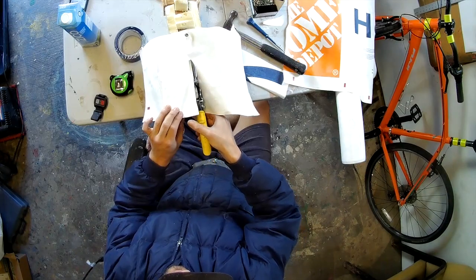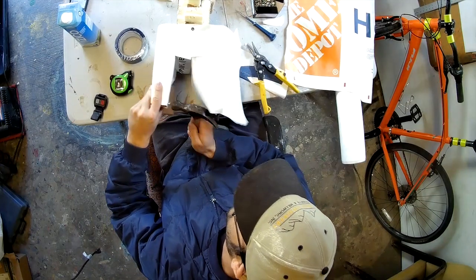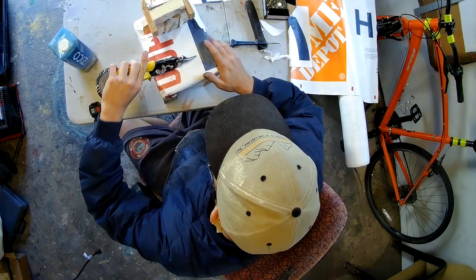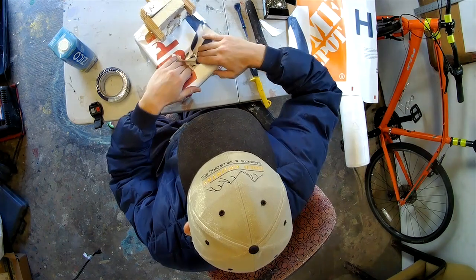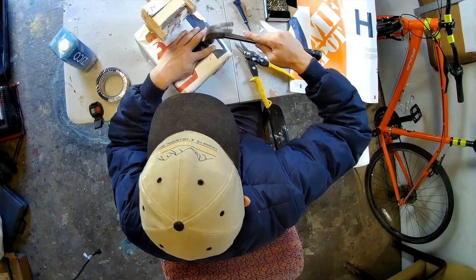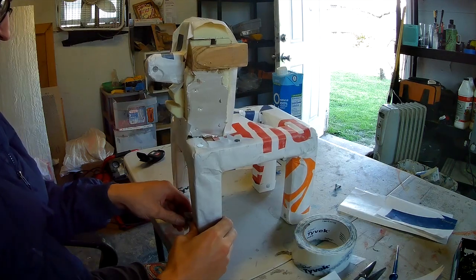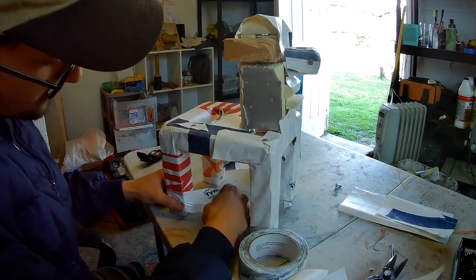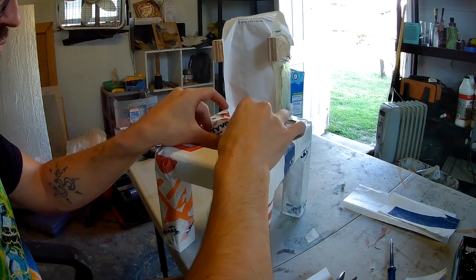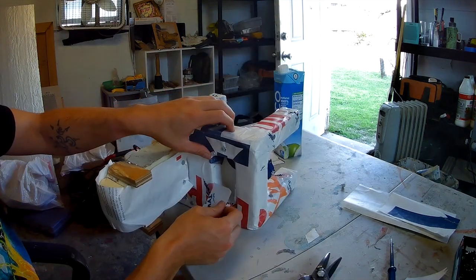Here I am adding house wrap, and this is to prevent any moisture from getting inside the wood, which would cause the wood to start rotting and expand, causing problems down the road with the cement. And here I am adding some special tape, which is used to cover the seams and get a good seal to prevent, to the best of our ability, any moisture getting in there.